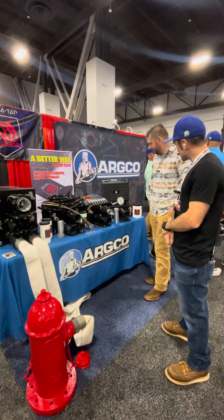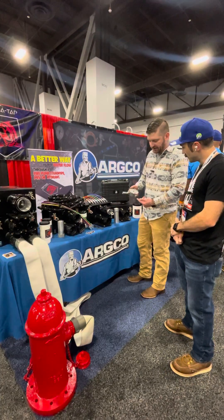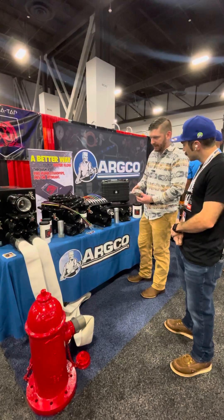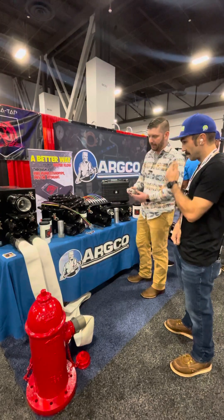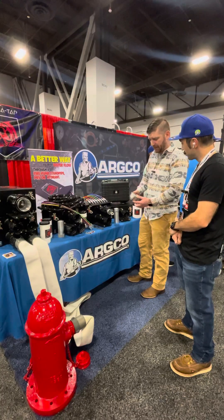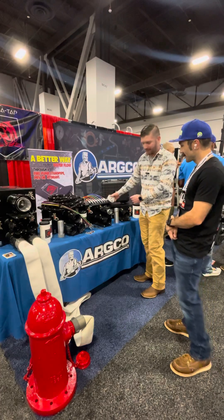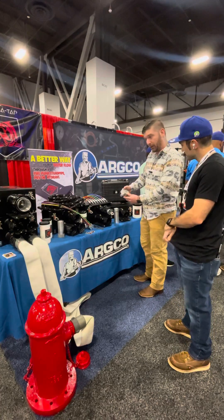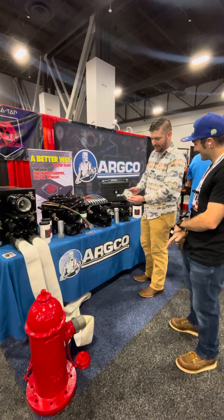And your gauge is special? Yeah — so traditionally, gauges have a connection at the 6 o'clock location. But when you stack, the diffusers would impinge upon the gauge or the gauge would impinge upon the diffuser, so you have to have a connection to the side. You'd pipe over with a Street 90 to connect it. We rotated that so you don't have to crane your neck — it's not very ergonomic. So you can walk right up to it and see it.